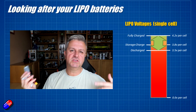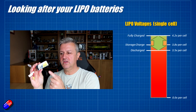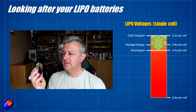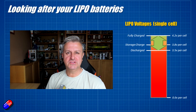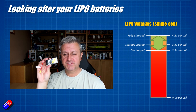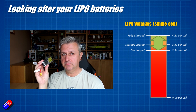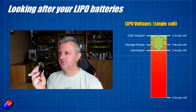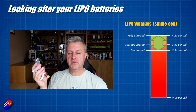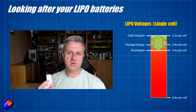When the battery is completely discharged and ready to be charged again, the minimum voltage per cell is about 3.5 volts. So you've only got 0.7 of a volt between the battery being fully charged and being considered empty. That is one of the great things about LiPo batteries — because as the battery discharges, motors turn more slowly, but even at the end of the flight, the drop-off you see with other battery types isn't there. What you need to make sure is that when you are using the batteries, you don't go below 3.5 volts, because you start to cause irreversible chemical changes within the cells, which will shorten their life and degrade their performance.